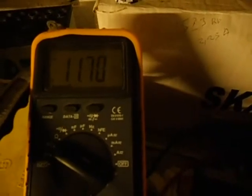We got a little power as well, so in fact I think there must be going somewhere around 50 amps from this alum battery into the inverter to get this power. So this is not bad — I can mow my grass with this car battery on alum, pull it down to maybe 10 volts without a problem, and charge it back up again. The alum can put out a lot of power.